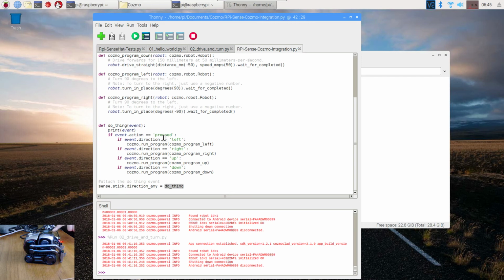The reason why I built that thing is because Cosmo does come with a cliff sensor. So if Cosmo is going to fall down from the edge of your table while it is in its regular operational mode, then Cosmo will avoid that fall. But if you are using Cosmo with the SDK features, you take control over that. So just to avoid him falling down because somebody kept pressing the held, I tried to not include the held over here, but only the pressed over here.